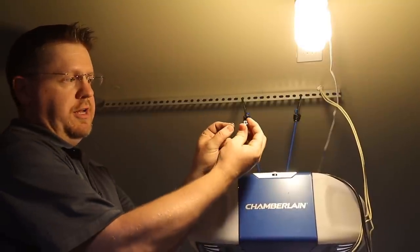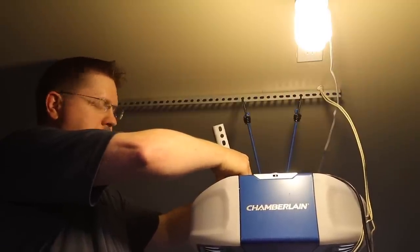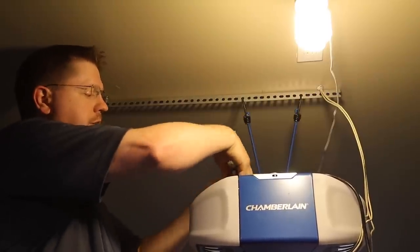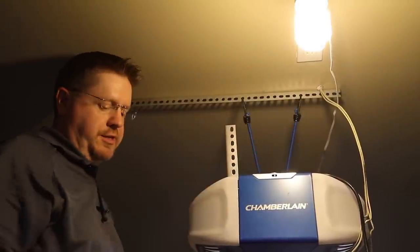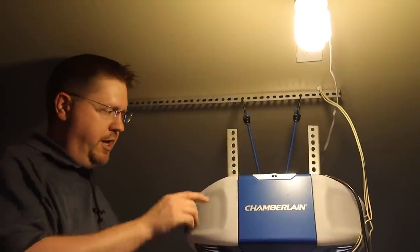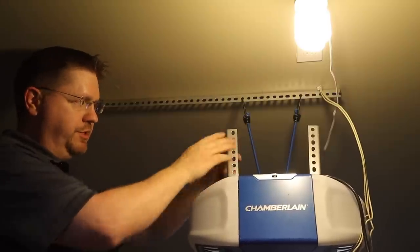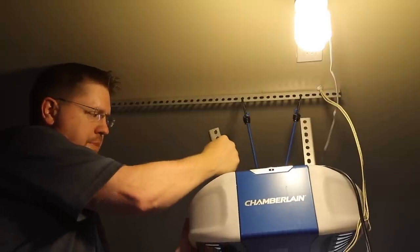For installing these brackets, I have a small bolt with a large fender washer, and then it'll go through the bracket and need a lock washer and a locking nut. If you don't have bungee cords you could set a box on the top of your ladder, or use a second ladder to support the rail — anything you can do to get it suspended in the air will make this job very easy. The brackets on top of the motor are folded up from the steel of the case and will bend down relatively easily. Grab and bend them over — once tight this is not going to move at all. Now remove the bungee cord.